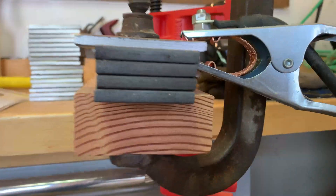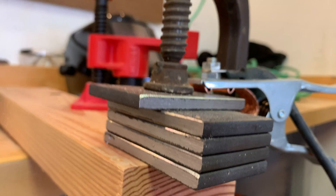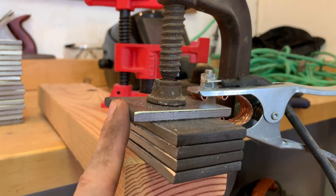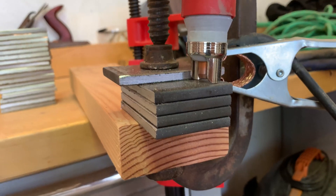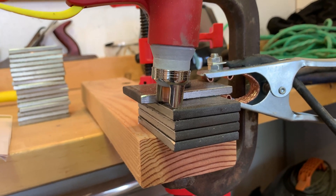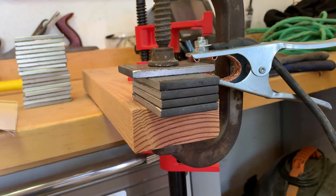Here are my plates all lined up, and I have a plate on top to give myself a straight edge to pull against. The plasma cutter does come with a standoff guide, and I'm going to use this straight edge to pull against to give me a nice straight line so it looks really good if it makes it all the way through.